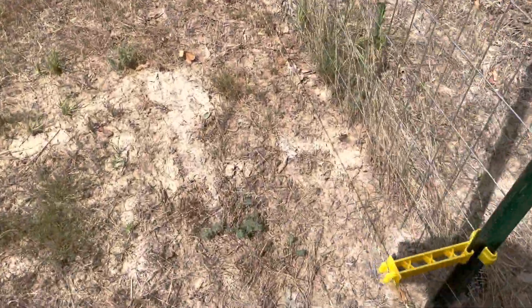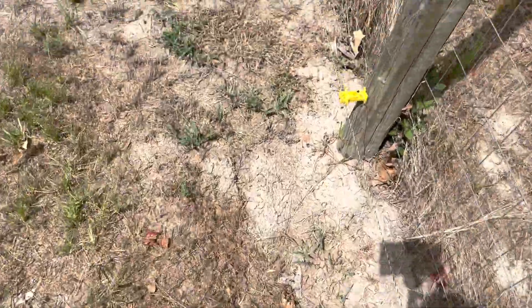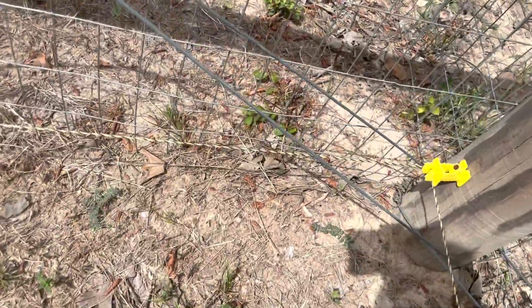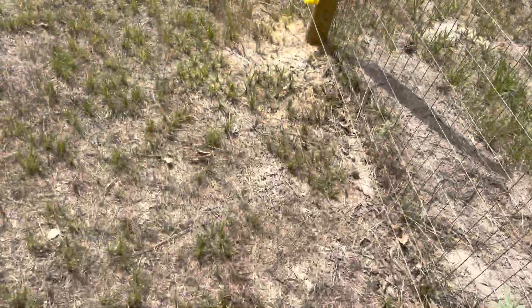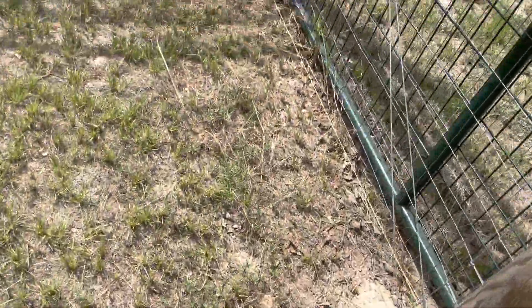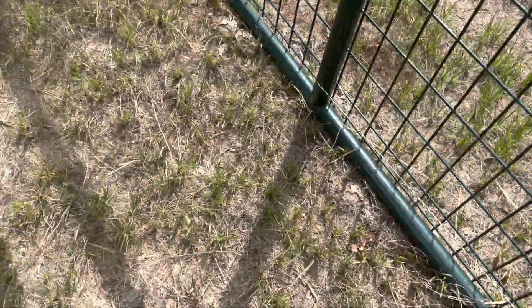You can see how these connectors work — there's an over and under section where the wire runs through. I keep the line clear of weeds, grass, and debris. That does need to be watched, as it will ground your wiring out and reduce or even eliminate the charge if there's too much debris on your line. Walking and looking at these lines regularly is very important.